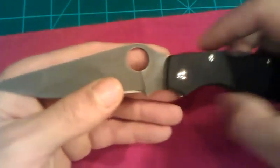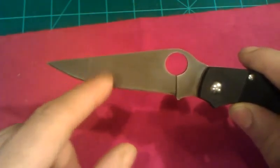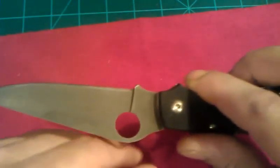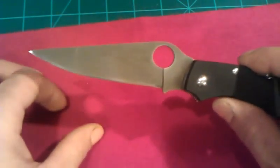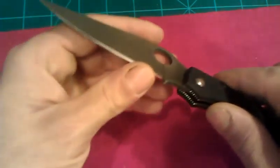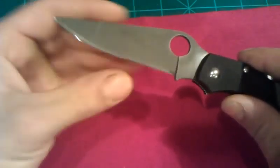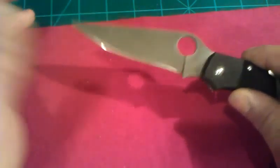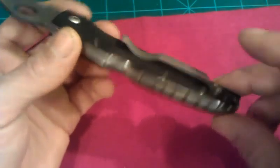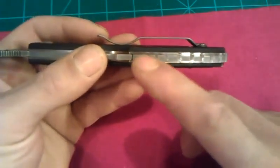I'm probably going to re-dip this blade because there's some mild marking that goes diagonal and a little scratch on the other side. I only left it in for about 15 minutes. This is 440C, and 440C took the acid wash pretty good and pretty quick. I did have to re-sharpen the edge because the acid took the edge straight off — 440C's edge retention isn't all that great, but it sharpens back up in a heartbeat. So I'll take it all back apart and re-dip the blade and the backspacer.